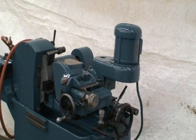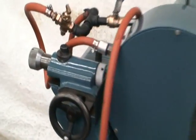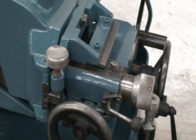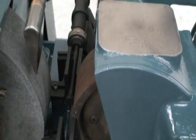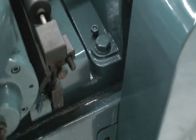It has a manually operated profile grinding wheel dresser and a manually operated regulating wheel dresser. This work rest here can be used as a through-feed type work rest or an in-feed type, and the in-feed system also has an ejector — a manually operated ejector tied into the hand wheel here, so that when you operate the lever, spring action kicks the work out.